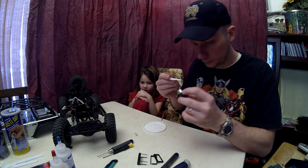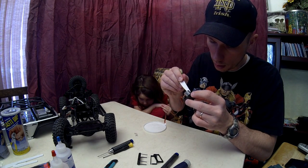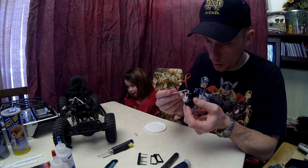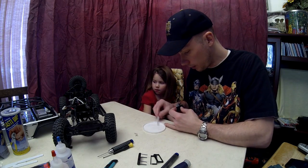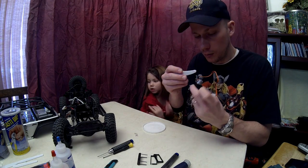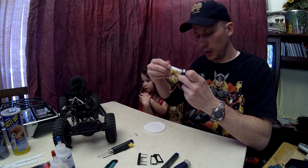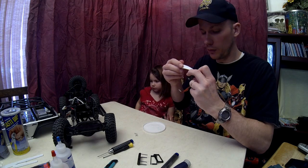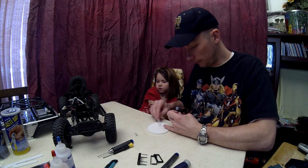But in just a second here, I'll show it all to you. I'm just getting around the edges of the circuit board, right on top of the wires coming into it, because I'll tell you right now, probably one of your biggest problem areas on all servos is where the little rubber gasket comes right onto the servo itself, where the wires go in and the rubber gasket on the edge. That's your worst spot.